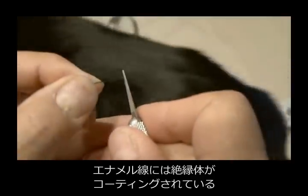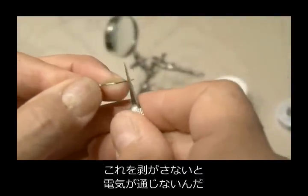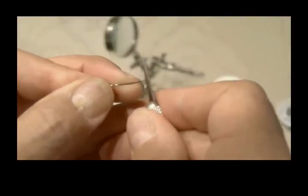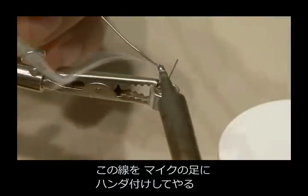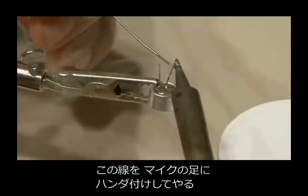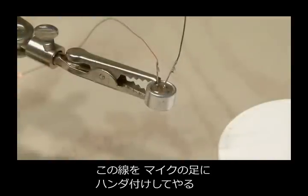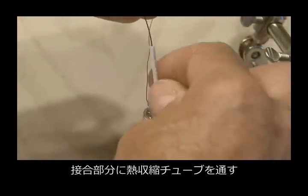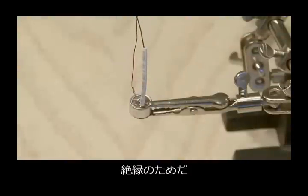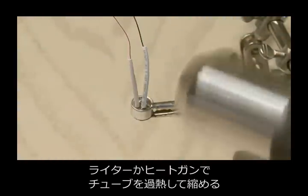The cool thing about magnet wire is it has an enamel coating, which needs to be scraped off so you can make contact with the solid core inside. Then we'll be using this metal alloy and heating it up to around 670 degrees until it melts, which will allow us to join the magnet wire to the microphone contacts. Then some small diameter heat shrink tubing is placed down over each of the leads, to keep them from touching each other. Use a lighter or heat gun to shrink the tubing.